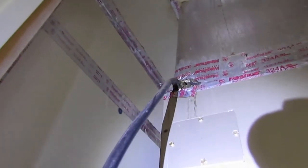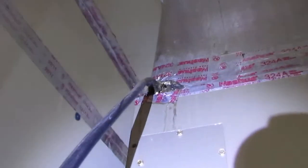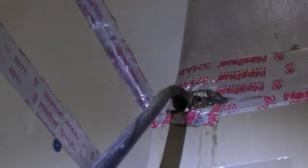You've got a distribution cable coming through right there at the distribution trunk, and you can see a lot of dark staining around that, so it's probably discharging some air from that as well. That needs to be sealed. But the main thing I wanted to show you was down here in the return itself.